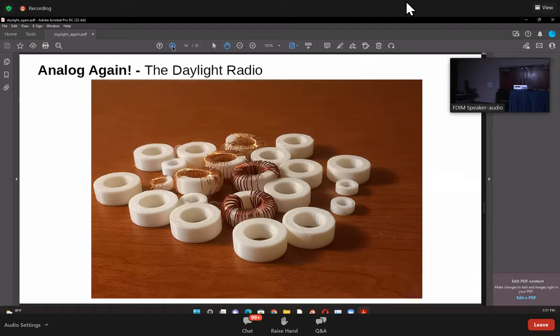So again, how do you know how much inductance this is going to give? That's actually pretty easy to do. You take a capacitor whose value is known, and put this in series with that, okay? And strap it between the input and output of your NanoVNA or your Antuino, and you'll get a notch somewhere. The precise center of that notch will tell you the frequency at which it's resonating, and you can work back what the inductance was, because you know the capacitance and you know the frequency. Pretty simple to do.